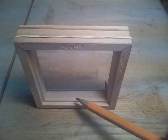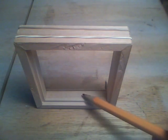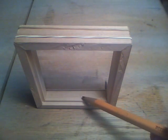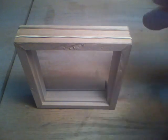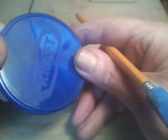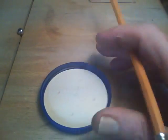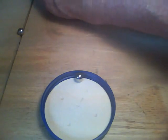One thing I forgot to mention is the distance between the rabbet and the dado has to be a little greater than the size of ball bearings you're going to use. I've got about 425 thousandths here and I'm using 3/8 inch ball bearings. I made up a little prototype — I just took a mayonnaise lid and cut a little piece of eighth inch plywood, and I put some eighth inch dimples in there with a drill, and then I can drop in my ball bearings.